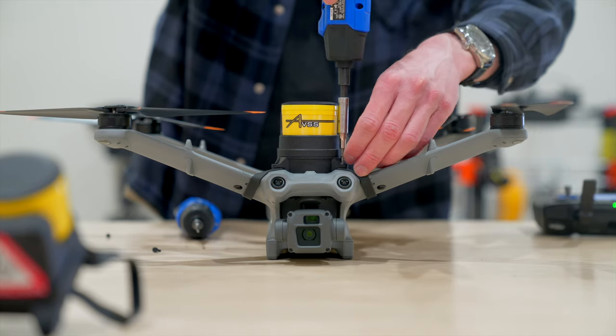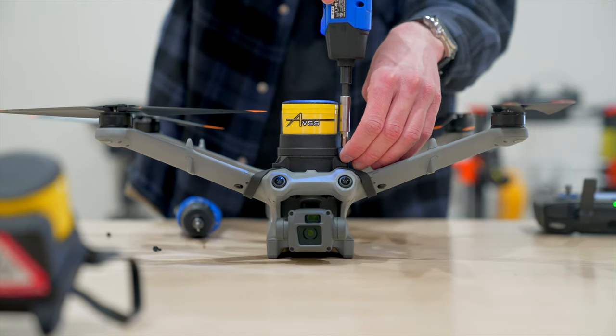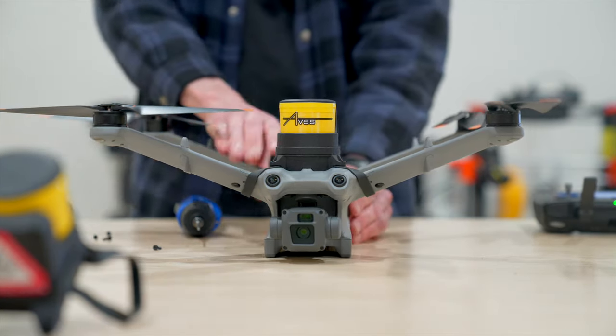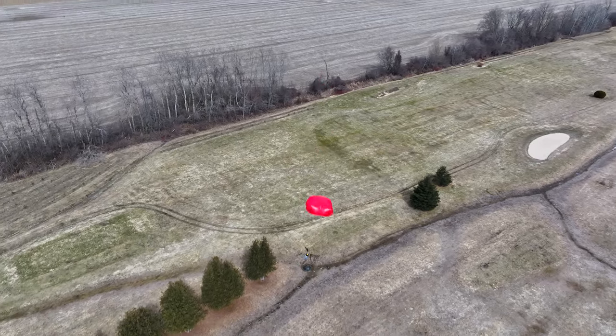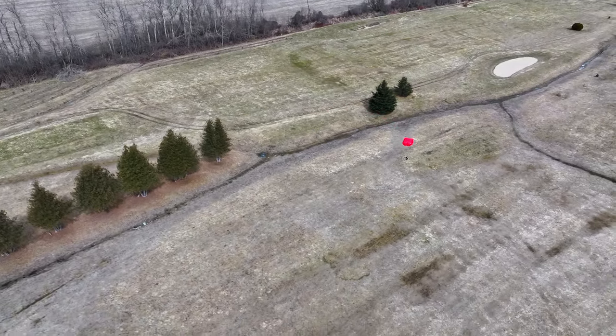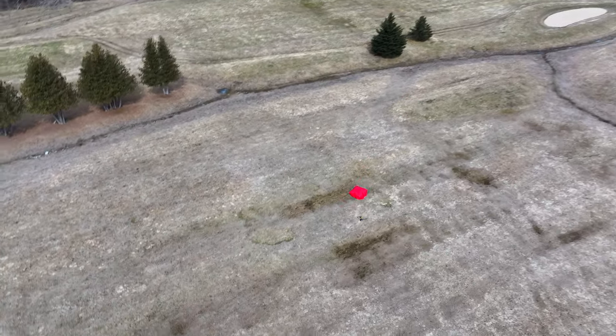In this case, AVSS's parachute is able to plug into the drone to draw power and also send commands to override the flight of the drone. For example, when it comes tumbling down from the sky, the parachute can send a command to the drone to stop the motors. If these motors kept spinning, they would cut up the strings and make the parachute useless. It also could lacerate someone on the way down if those propellers were still spinning at maximum speed.